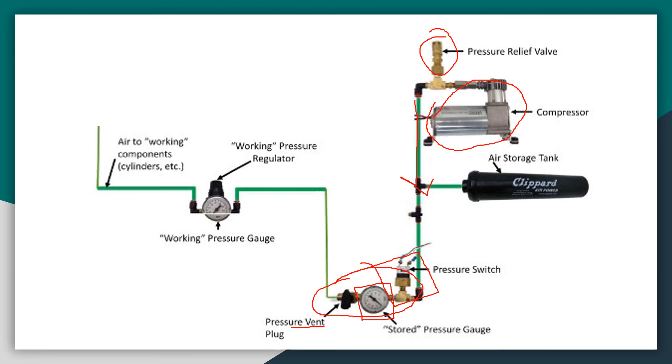Once we have these things, we can actually do something with this pressure. First, we regulate it down from 120 to 60 psi with the pressure regulator. Notice that this does have a pressure gauge on it — it is actually a rule to have a pressure gauge on your regulator so that they can tell you're working with 60 psi only. Once you regulate it, the air will go to solenoids and then to pistons.